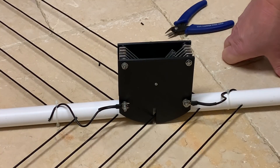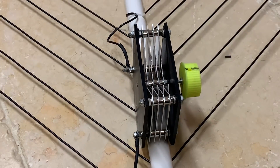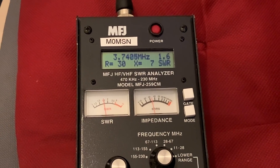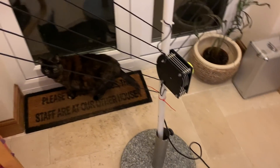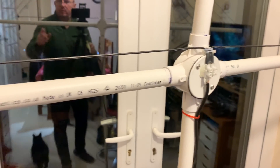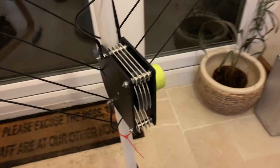Our capacitor is on our loop. We've got an SWR of 1.6, which isn't brilliant but it's not bad. We could probably get a better SWR if we decoupled this slightly - I think this loop could probably be a little bit smaller. But the SWR changes, so let me get this in a decent position for you.